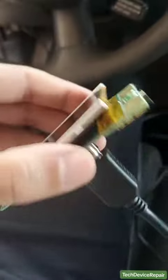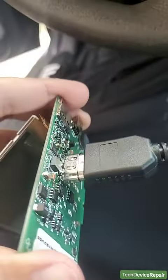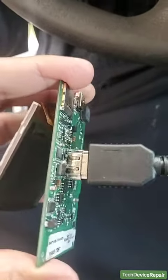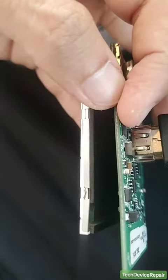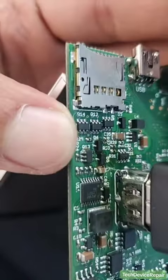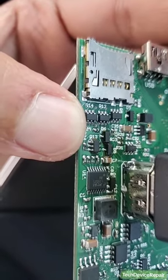It's not that at all — something more serious. I put a brand new port on here and it's the same problem. However, check this out — it's turning on when I put my finger right there. There has to be something wrong with the capacitors in that area. Let's go check it out.